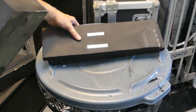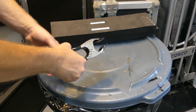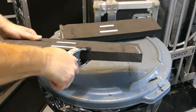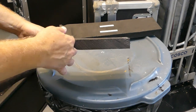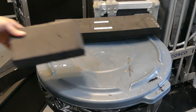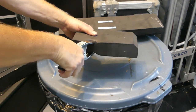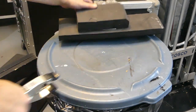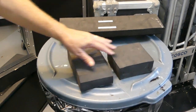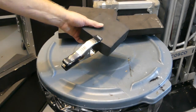All right, so for us, the density of the foam is very important. For example, I think everybody's seen clamps like this, and I don't remember how many pounds that is coming down on it. But if we squeeze this here, you can sort of see how much it's being compressed. Now, if we take a bigger piece of foam, this is about the same consistency, it's just a bigger piece. We get the same thing, which is what we want. Now this foam here looks pretty much identical. It's all cross-linked polyethylene, but this foam is extremely dense. This would probably not be a good option.